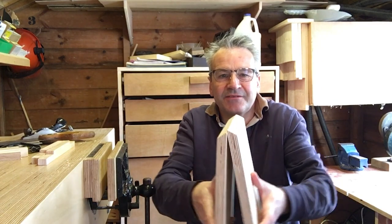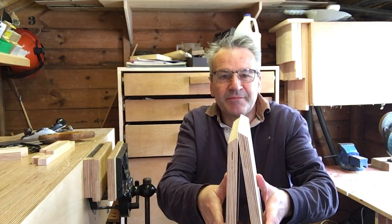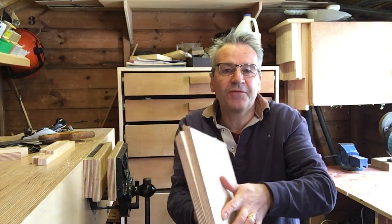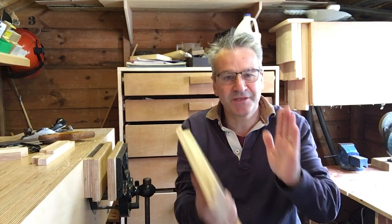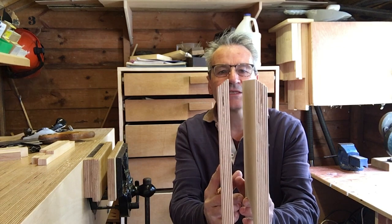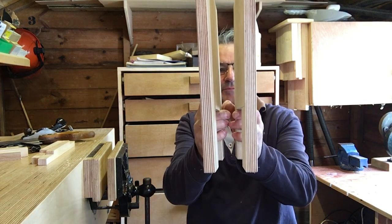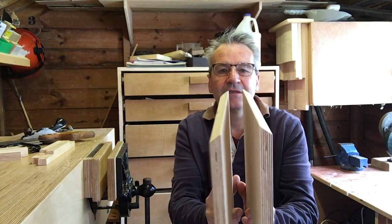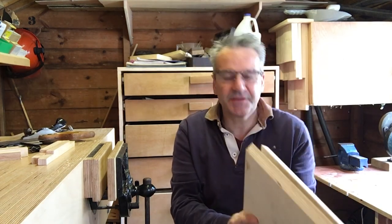Anyway, I've seen a few designs, and some of them use a fancy hinging system so that you can clamp at the other end. Problem with that is you then have to profile the clamp itself so that it squeezes together, taking into consideration the angle. So I thought, you've only literally got 2 millimeters that you actually need, so why not go parallel like this and just fill it out at the bottom with some packing pieces and it should clamp okay. So this is my design, basically.